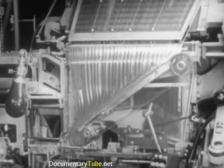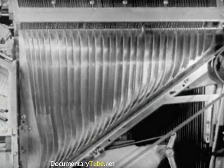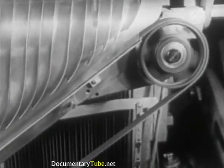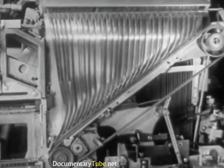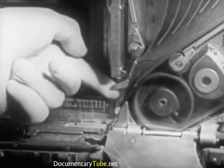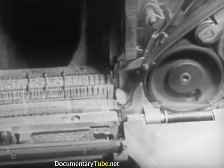The mats released from the magazines are now directed toward the assembling elevator. Now we will see the whole operation in slow motion. They are guided in their descent by the assembler entrance partitions, which prevent them from turning out of correct position. The mats fall upon a delivery belt in constant motion, which carries them in correct sequence to the assembling elevator. It takes the same length of time for all matrices to reach the assembling elevator, due to the design of the assembler entrance and matrix delivery belt. Before reaching the assembling elevator, the mats have to pass under a small spring blade, called a shoot plate, which cuts down their speed, so that the rotating star wheel can turn them upright and move them forward against the others in the assembling elevator.